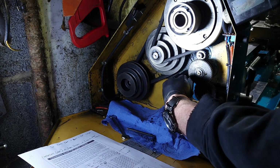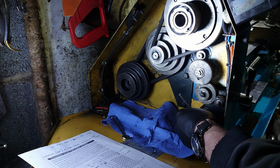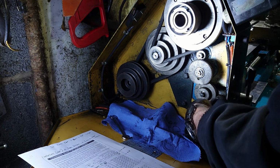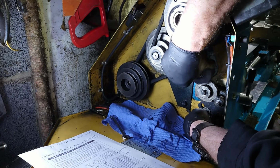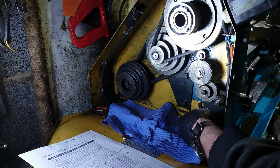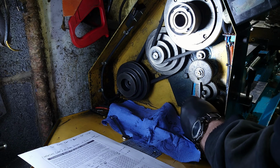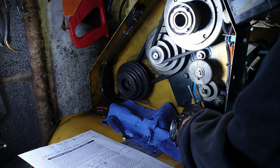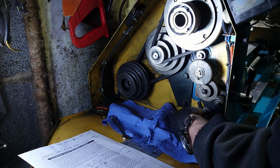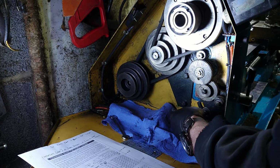So we're in the gearbox here, we're in neutral at the moment, so I can spin these round to engage them. So what we're going to do now is bring this back up, and engage those two. There we go. This Allen key comes as part of the toolkit, by the way, because you do get a toolkit with these, basically to allow you to change the speeds.